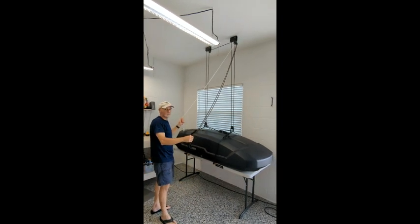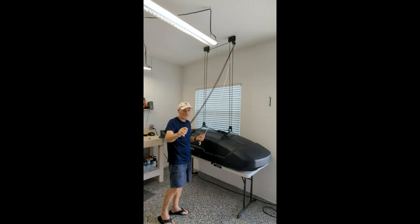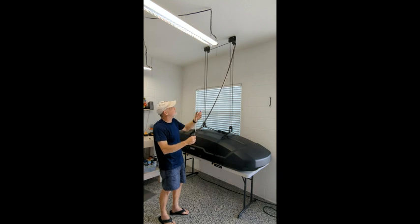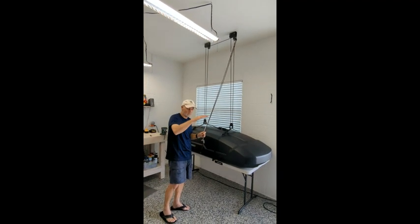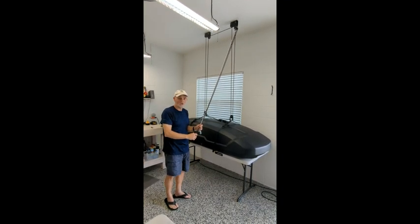But be careful — you still need to hold the hoist load lines when you're dropping this. If you were to let go of all the lines, the lock would come up, and you're going to probably have a pretty good static load drop. So that's my solution — hope it helps.